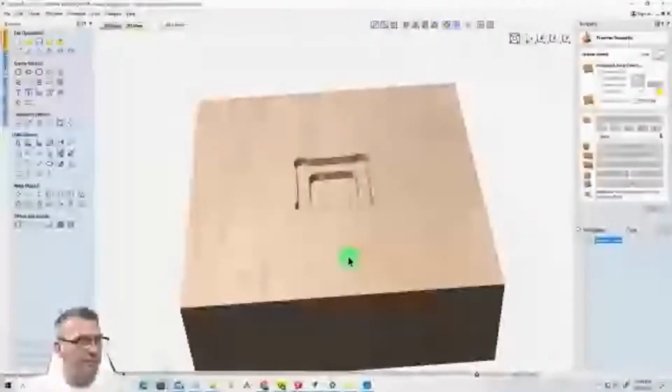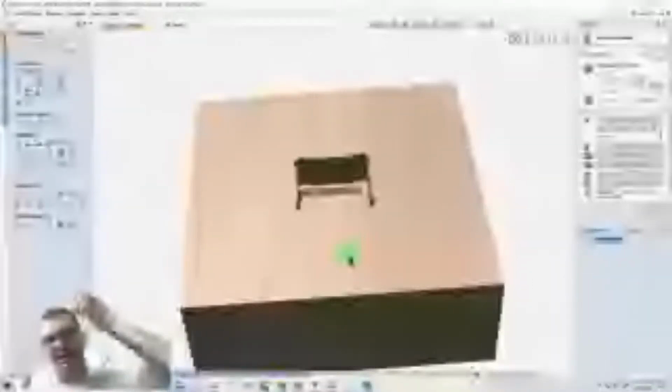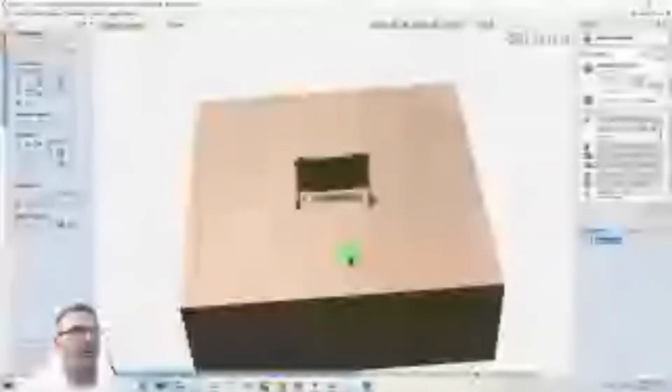Okay. Once that's done, that part gets turned 180 degrees, pushed back into the jig, zero out on the top. Make sure you get it seated down in that jig, right? Don't have it sitting cockeyed or whatever. Get it seated down in there. But still zero out. Don't assume anything. Zero out on the top. And the next toolpath is going to be, let's ungroup that. Now I'm kind of just going to stack this. That gets centered. And it's the circle.